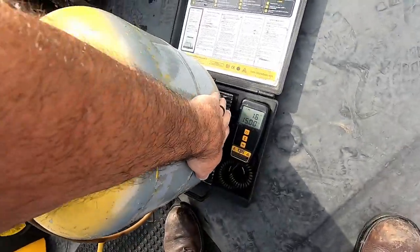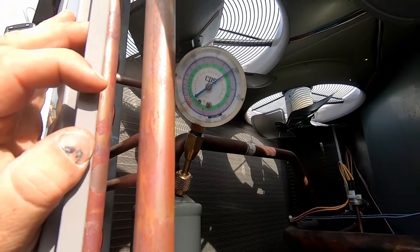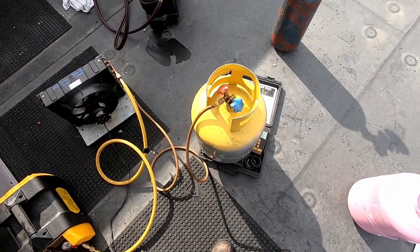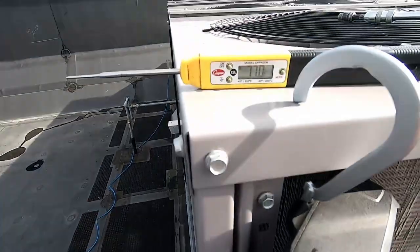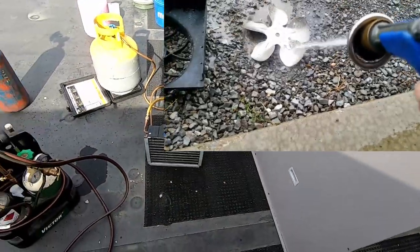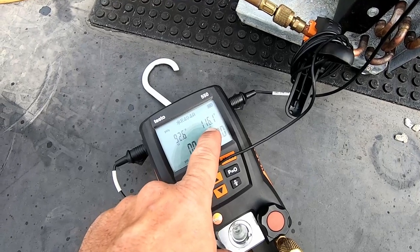The tank is warm but not blazing hot like before - right about 104 degrees. We're about 187 PSI, still holding pretty good on the head pressure at about 360 PSI. Switching to the liquid side to see if that helps stir it around a little more - heat has to rise up. Even though it's got the restrictor in there due to the dip tube. Temperature outside is about 77 degrees. Head pressure's up a little bit, almost 400-405, temperature going in is 116 coming out at 92.